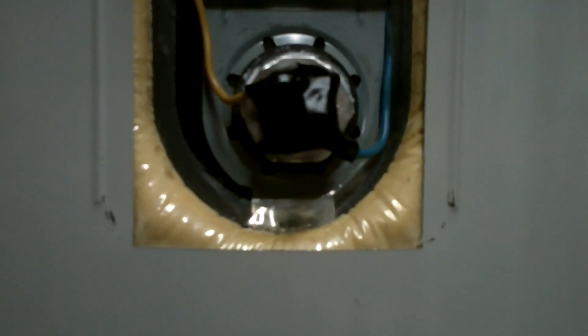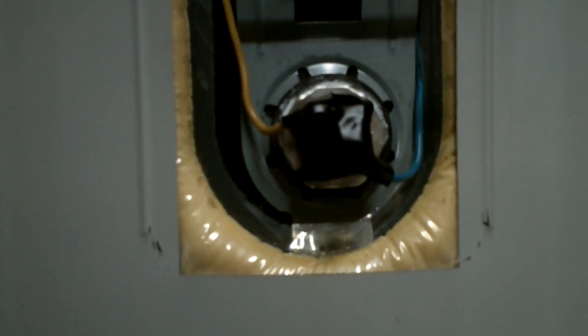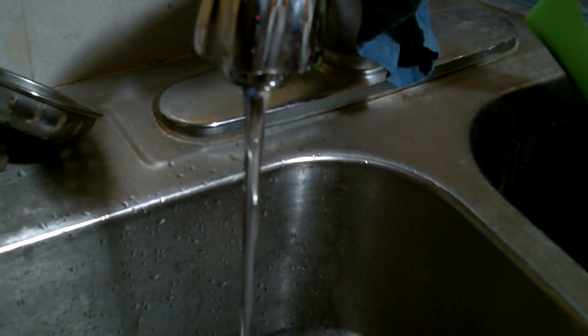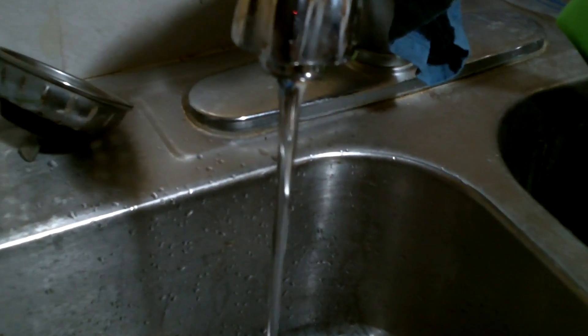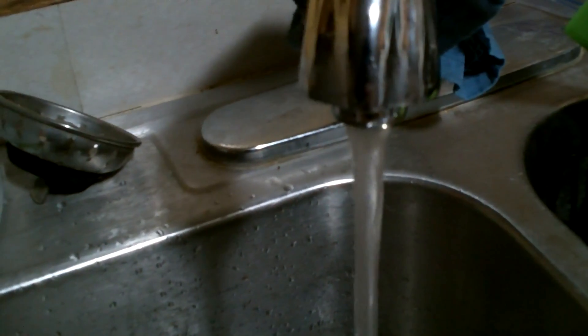You can hear it gurgling and popping and slurping while it's filling and getting water back to all the faucets you opened. I'm going to leave one faucet open for now, and when it's fully purged of air, I'll close that one and open the other. The kitchen faucet doesn't have the right pressure yet, so I'm waiting for a good steady flow before closing it. Closing it briefly helped build up pressure in the system. It's now flowing pretty good without any air pockets or gurgles coming out anymore.